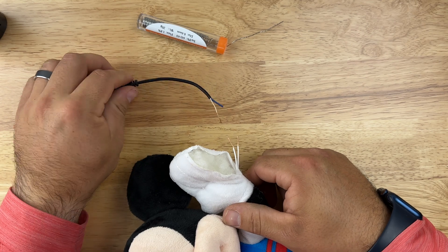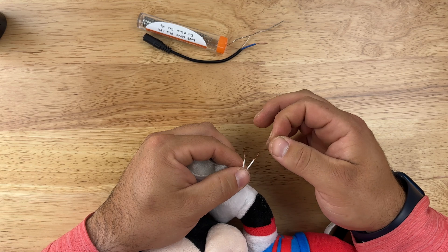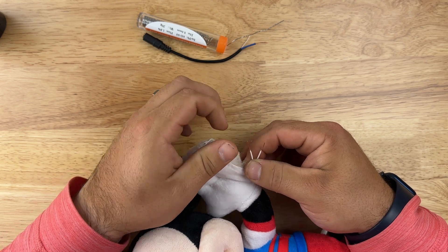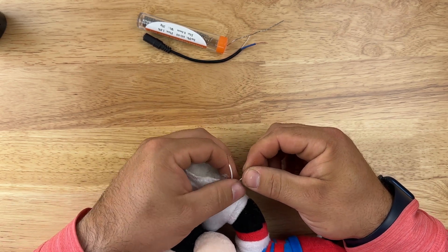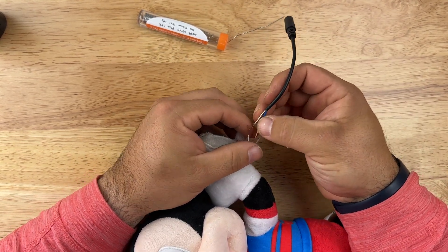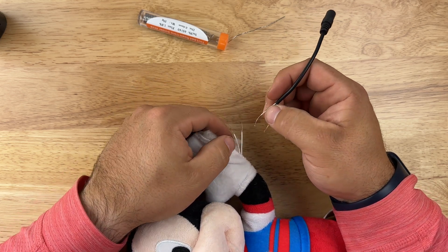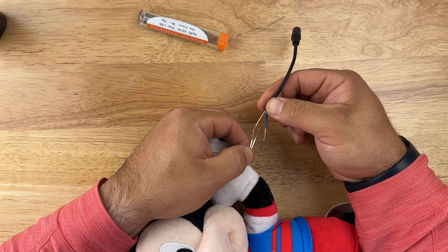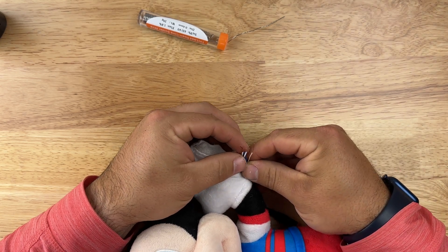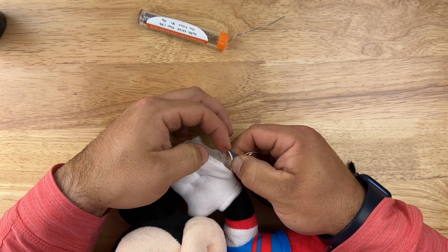You're ready to solder your wire to your toy — you've opened it up and identified a couple of wires. There are basically two ways to do it: in-line, where you twist the two wire ends together to make one continuous wire and solder them, or you can join them side by side and twist them together. The side-by-side way is much easier, while in-line is a bit more proper, but either will work fine.